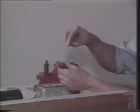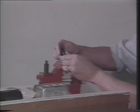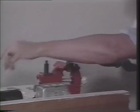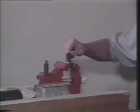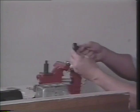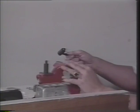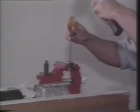If this one can't, take the other piece, which is the breaker, and screw the handle into the breaker. Put it into the cylinder, twist it in the direction that the cylinder opens in, and that will twist the cylinder loose. Now this can be used by itself on some locks. It's real good for padlocks. It's real good for rim and mortise cylinder locks, breaking it loose. Once you've got it loose, the cylinder can be just popped out that easily.